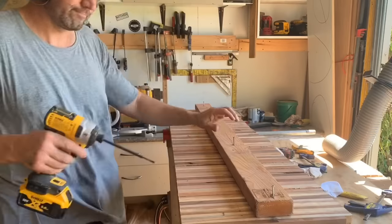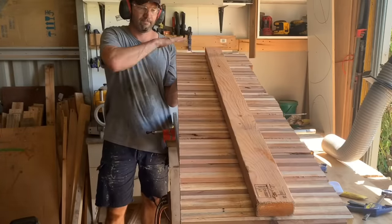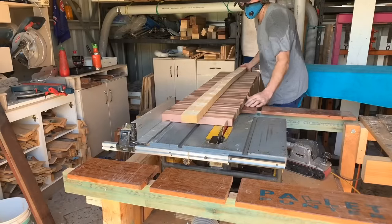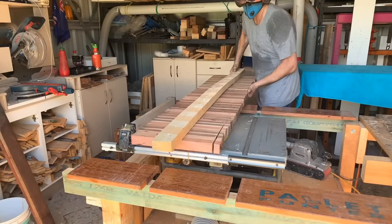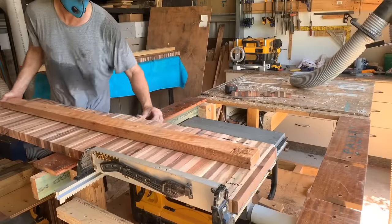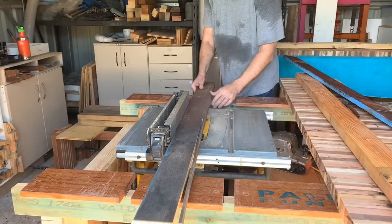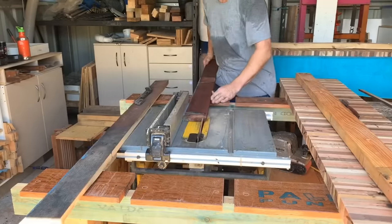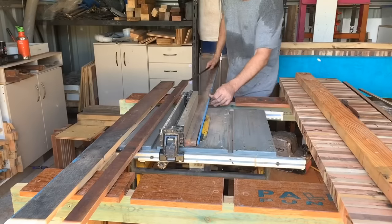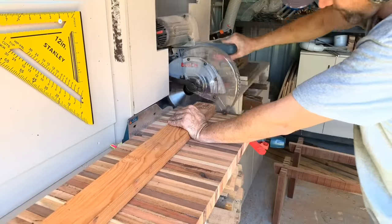I've cut my first straight edge with a circular saw, then I'm going to throw on a little bit of rough timber for bracing and cut the second side with the table saw. The weight of this slab as it comes out the other side of the saw means there's potential that it might break — remember, I just used that cheap PVA glue, so without the structure it may fail. After this job and a few others, I decided my next video is going to be me making an extended fence and an extended outfeed table, because running that big stuff through isn't the safest or most accurate method. There'll be a video coming dedicated to sorting that issue out.